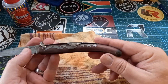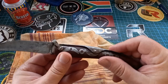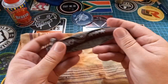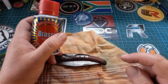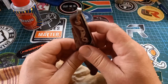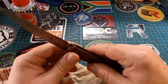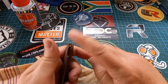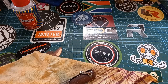All the rust is off, everything feels nice and smooth and it's looking pretty good, but quite dull because water and soapiness will do that to a knife. Now let's do some Brasso. When I'm done with that I'm going to spray this whole thing with Tool-in-a-Can to flush out the insides and protect everything with the oiliness. I just need some sandpaper first.